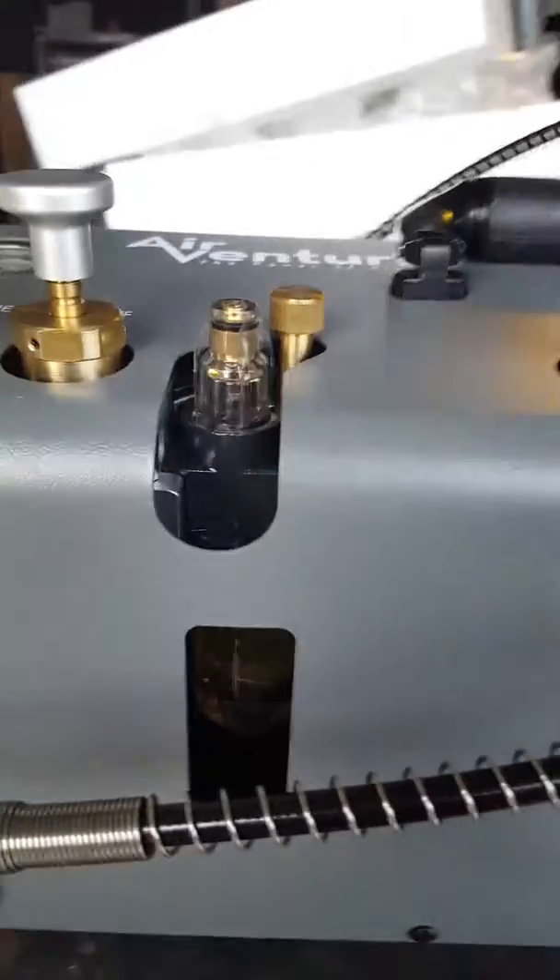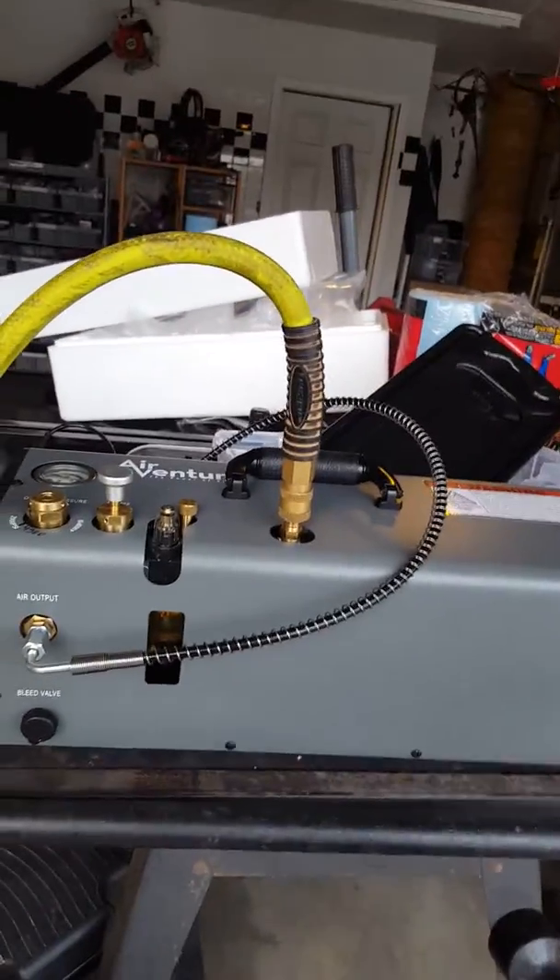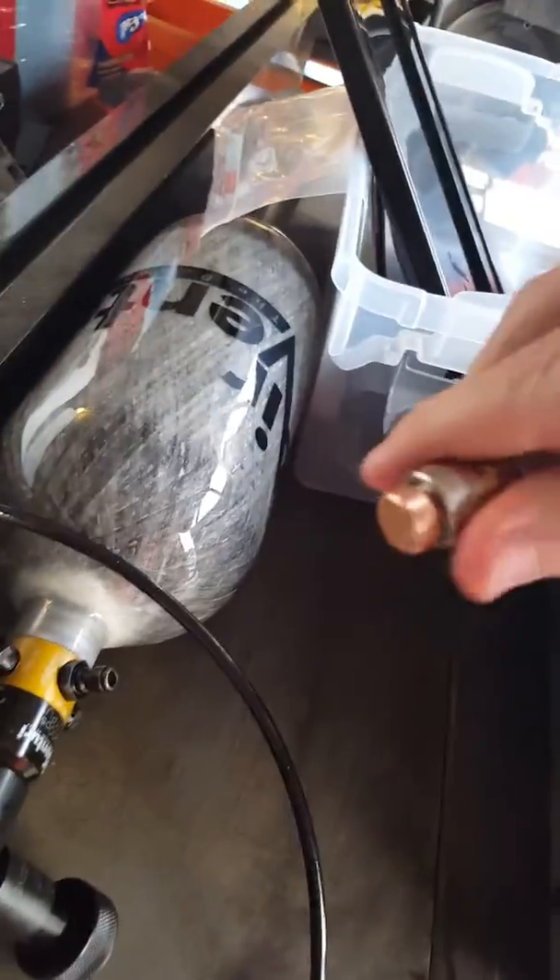I've got to make sure that the oil is at least halfway up, and it's completely full with just compressor oil, which is SAE 30. Then I've got my tank here. This is the fill port that goes into the gun, and this is the quick connect that I'll plug into in order to fill it. It comes with a test plug — that's to close it so you can test the pressure to see what you're outputting.